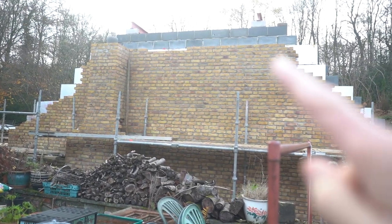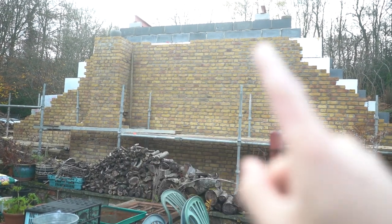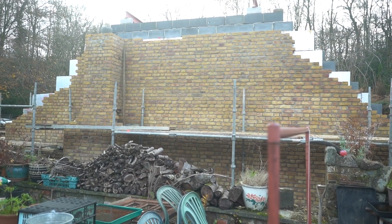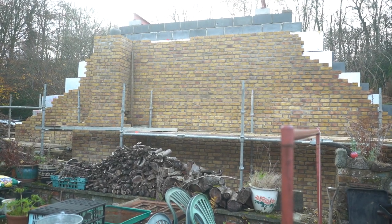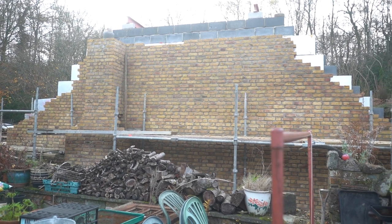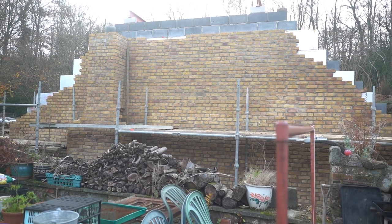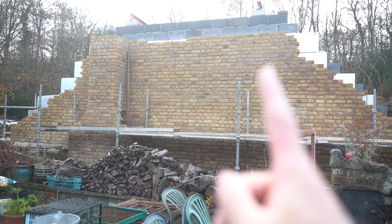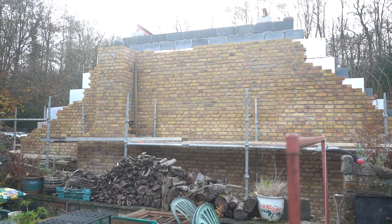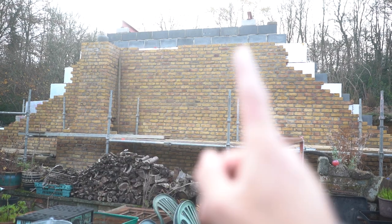This side is almost done. This level here is where the scaffold is going to be - the chimney stack is finished relatively close to that level. Once the scaffolding's up and they've put the roof in, I'm going to finish cutting this section up to the underside of the roof. There are a couple of spots I'm not very happy with - this greyish looking spot in the jointing and also this one here. When I was laying those few bricks it absolutely hammered it down with rain and I didn't get a chance to rub it up properly. This is what happens when you rub up brickwork in the rain - it goes a different colour. Not terribly happy with that but it will work its way out eventually. Apart from that I'm happy with the whole thing - the steel beams are visible there, looking quite good.